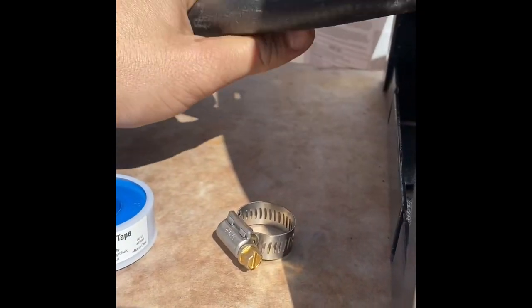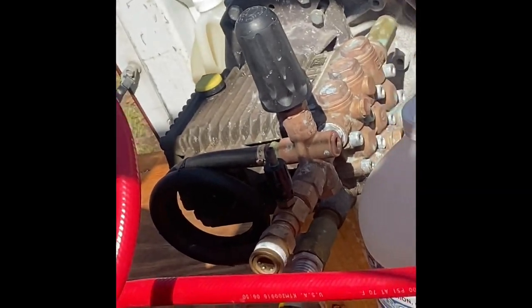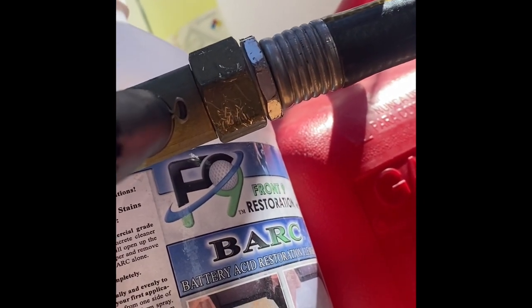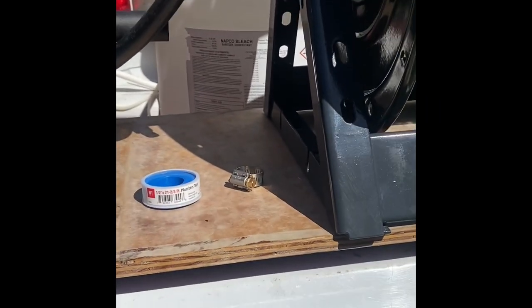It's going to look like that. Now this is the garden hose that goes from the pressure washer — you can see the garden hose is hooked up down there. Let me swing around so I can show you what's going on on the pressure washer side. The garden hose is just screwed directly into the rig. Now there's a filter in here which is going to stop debris from going in, and there's also a filter in this little fitting that comes with the General Pump hose reel — so you've got two filters that are going to filter out debris and any silt that comes from these spigot systems.